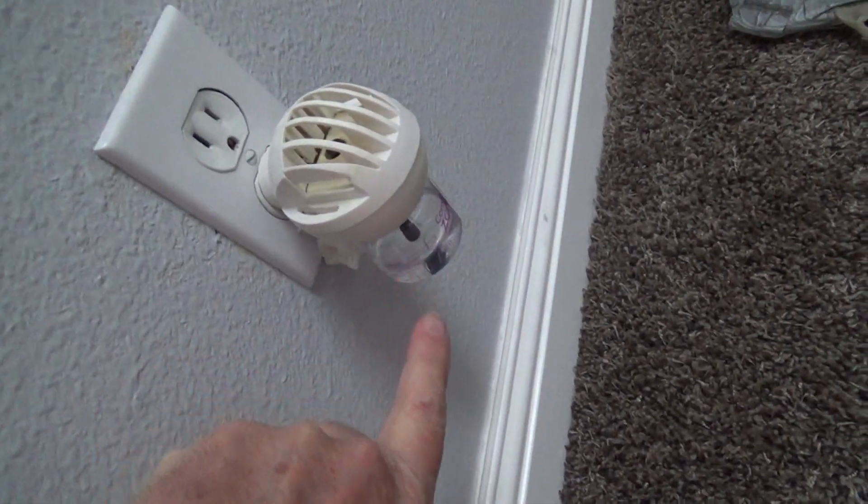I didn't install this stuff 15 years ago in this condo. I'm making the assumption because in lots of houses you have that. I've already turned the power off to this. I put little foam deals in here for insulation. If you have exterior walls, a lot of times you put your hand up there — if you feel cold air coming through, you can fix that by having these little foam pads. I did that on all my electrical outlets and light switches throughout the condo.